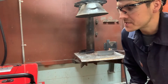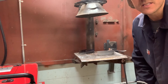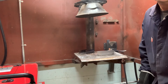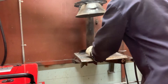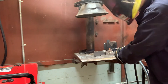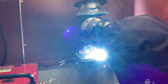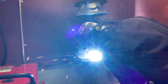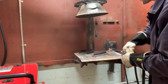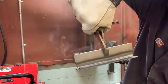Right now I have the machine set to about 600 wire feed speed, and we're going to go ahead and weld this 1/16th T-joint. It's mild steel — cold rolled. I didn't do much to it, I tacked the ends. And I'm done. So I didn't play around with the settings too much yet, but that took me about five seconds to do.